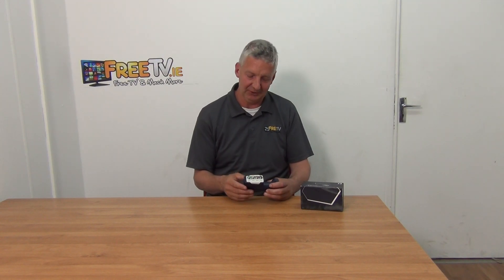The multi-switch then takes that signal and distributes it. A multi-switch might have four outputs, 8, 16, or 32 — or it could be cascade, which means it has 32 outputs and then runs the same signal out to another 32-way. So potentially you could run hundreds of satellite boxes completely independently, because it's impossible to split a satellite signal — it's not like a TV aerial; signals like this cannot be split.